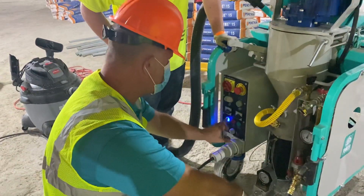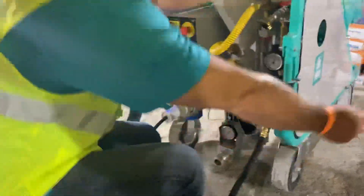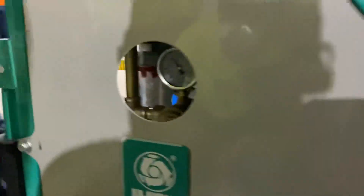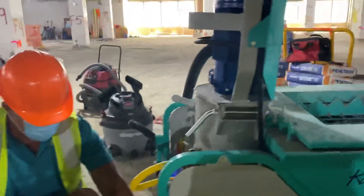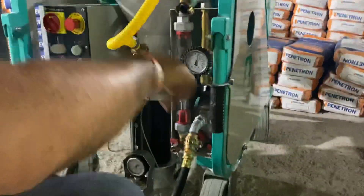Now you've got your electric hooked up and your blue light is fine. With your water hooked up, come look at this gauge — this is your water pressure coming in. It's sitting at about 34, which is fine, so you've got enough pressure coming into the pump. This is your booster pump; it will boost your pressure up to 70 PSI.